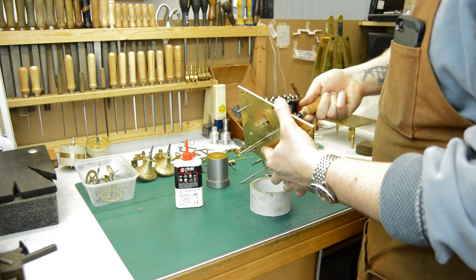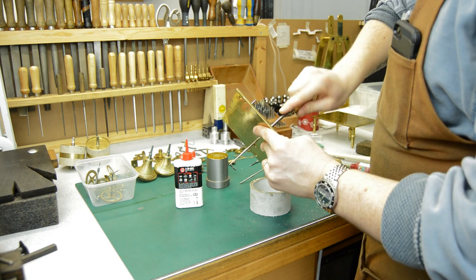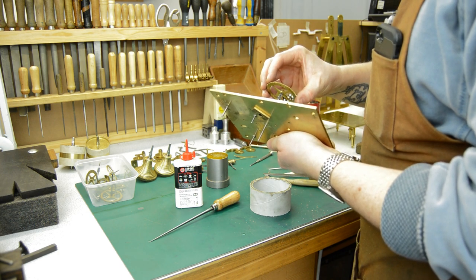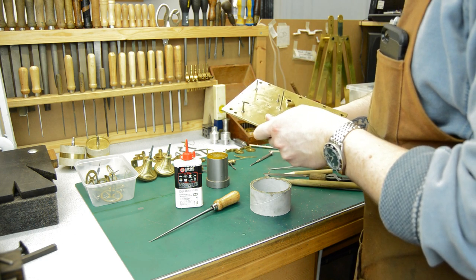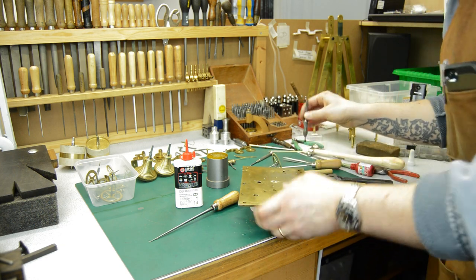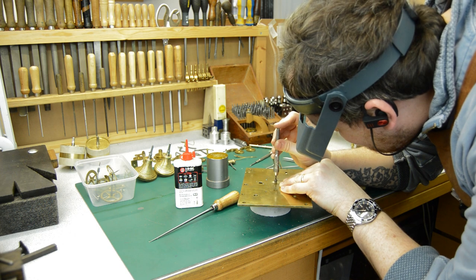This is a smoothing broach running through afterwards; I'm using a little drop of oil, and that burnishes the surface of the brass and further work hardens it. What I tend to do is to broach slightly tight so that it's not quite loose enough, and then the process of running the smoothing broach through does actually open it up a little bit further and allows that little bit of freedom that's necessary for the bearing.